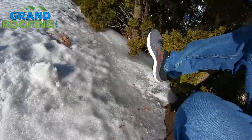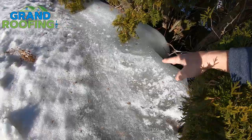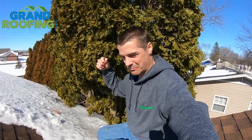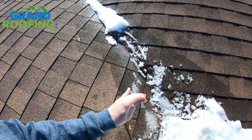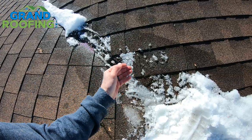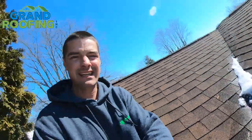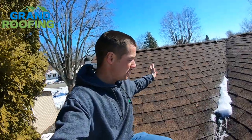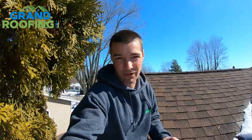Now the block of ice down here is a little different. There's an area about five inches thick, another section six to eight inches thick — it's not going anywhere. Your intuition might be to get a hammer or mallet and beat it. I advise against that. Unless you can lightly hit it, shatter it, crack it, and remove the pieces — you don't want to smash down into it. Taking a hammer to this is essentially the same thing as hail hitting your roof. Furthermore, if you smack a hunk of ice down in the wrong area and your mallet hits the shingle in a valley, that's a crucial section. If you crack the valley or crack the shingle, you won't know how much damage you did until the next rain runs down into the hole you put in it. So avoid that — don't be beating it. You can set yourself up for a bigger damage.